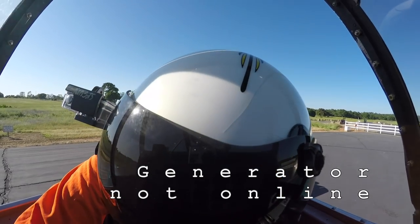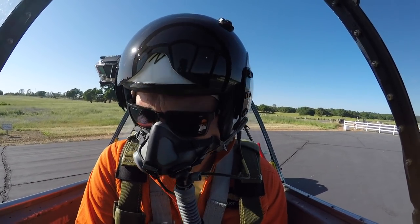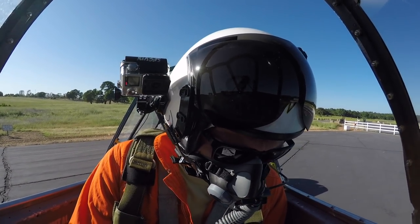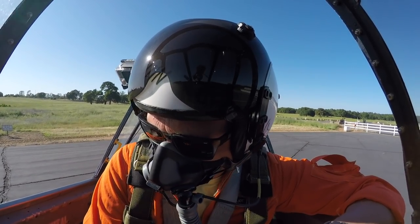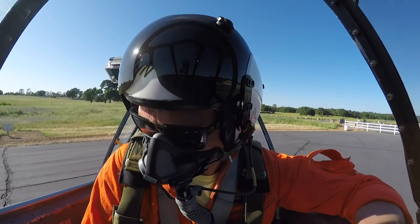On the frequency? Yeah, I'm here. Go ahead. Looks like we got a generator problem. Not coming online? Yeah, it's just holding right at 24 and a half volts. Generator is switched on and I'm looking for circuit breakers. We're on our way out.